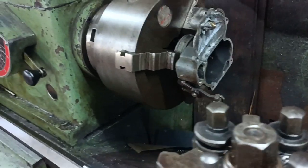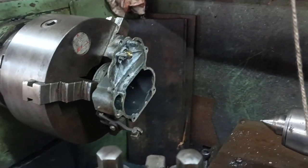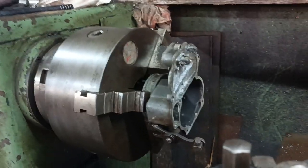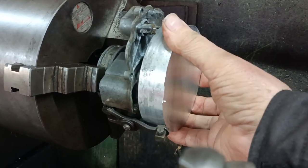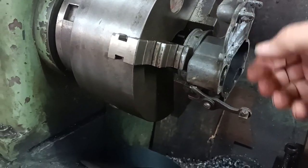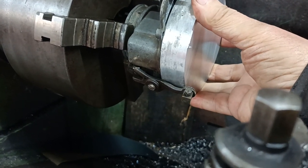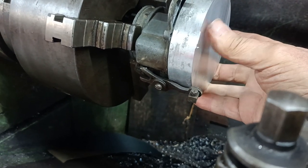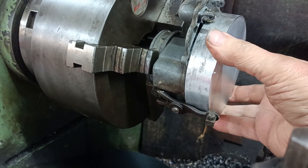Here in my lathe is a carburetor top, and the idea that I had was to basically cut this so it fits on there like that. I'll take that out and I'll take that out. That will go on there. I'll drill and tap some holes and screw the carb top on,